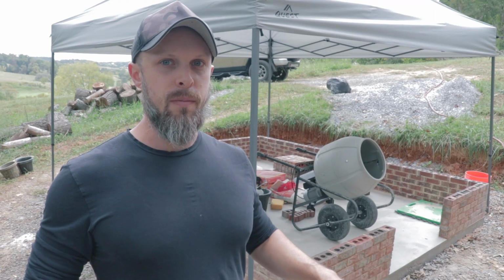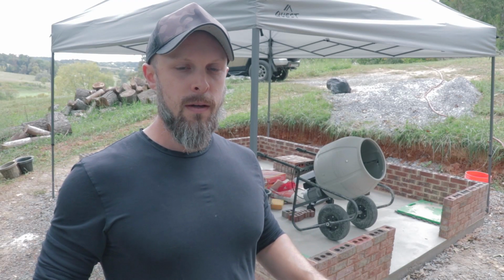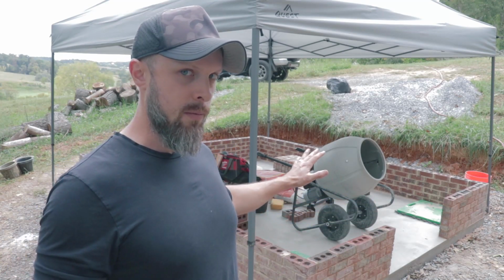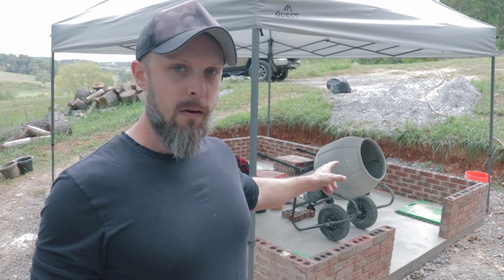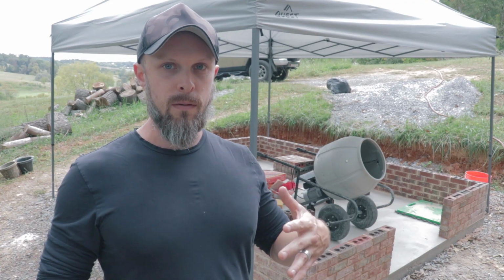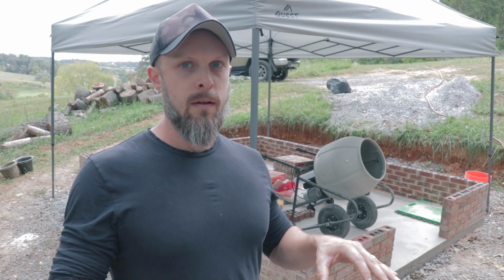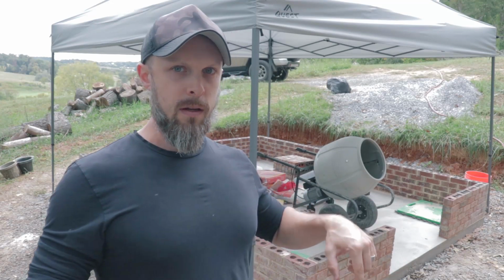And in this video, we're going to focus on how I'm building the stem wall foundation. Now that we have the concrete pad all completed, we're going to raise up the walls on top of a stem wall. And in this case, I'm using brick. So I'm going to show you how I'm doing this brick stem wall. I'm actually doing a dual layer, interior and exterior layer of brick, and then inside, putting some rebar and some bolts, and then concreting that in. So it's going to be a solid stem wall foundation, and I'll integrate it to the concrete pad as well.